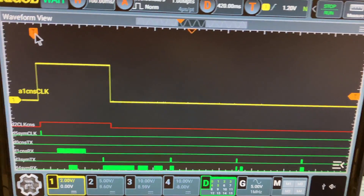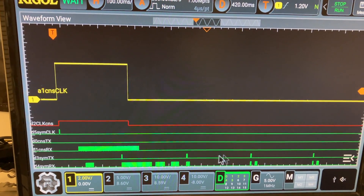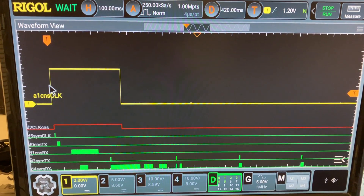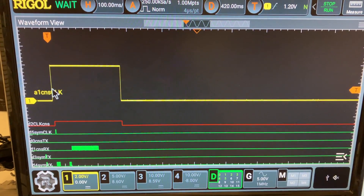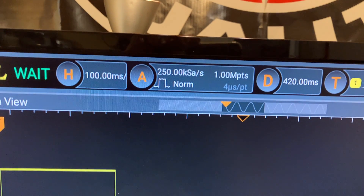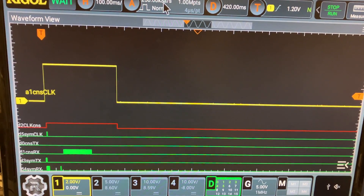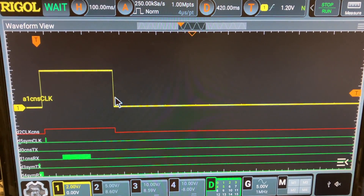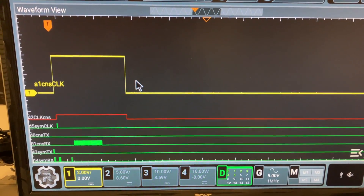With the clock adjusted to the left, you can see something very interesting: some events and traces in the communication that are not always at the same place. Now you can appreciate the timing of the entire packet — you get a better view of the context of how it works. The longest sampling time possible is 100 milliseconds with one analog trace and up to 16 digital traces. The best approach is to use one analog trace to inspect the health of the digital signal.